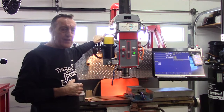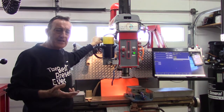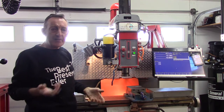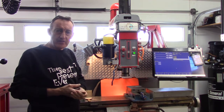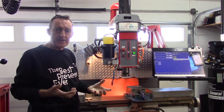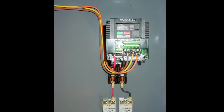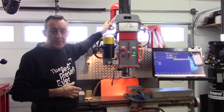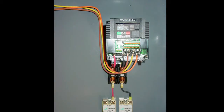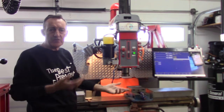So the other thing I want to mention is that anyone who embarks on a project like this, I've heard a lot of talk about the fear of three-phase power. And I'm a journeyman power lineman, so I know about three-phase power. And I myself started out with a phase converter, and I realized after a while that wasn't necessary. Now with the inverters that are available, they'll even run at 110 volts and convert to three-phase, and that makes everything so much easier. So basically, once that fear was gone, the only thing on here that's three-phase is the spindle motor. And so I bought a Hitachi WJ200 to run the spindle motor. It runs off of 220 volts, single phase, and it runs that just beautifully, and it's got infinite control, so it really works nice.